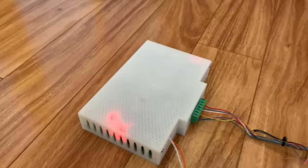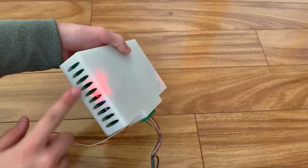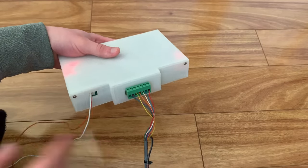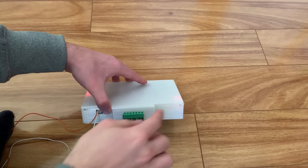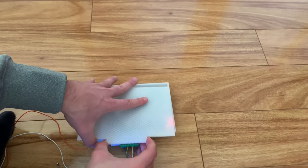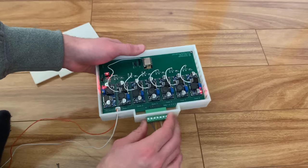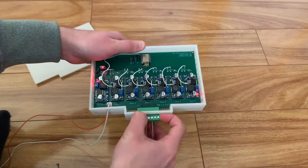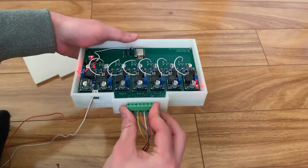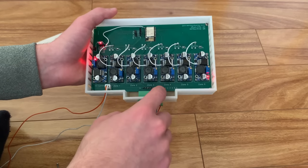Let's take a tour inside the box and look at all the components. This is a 3D printed enclosure I designed, with vents on both sides. On the bottom you have the port for the sign and input ports for power. The top cover is held in by two screws — you lift and slide it forward. Inside we have all the electronics controlling the sign. There's a 7-pin terminal block connector for the sign, which you can detach from the PCB. I had to add a secondary PCB underneath because I accidentally chose the wrong terminal connector when designing the original PCB.